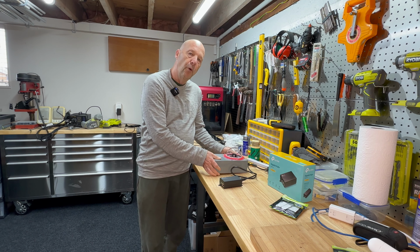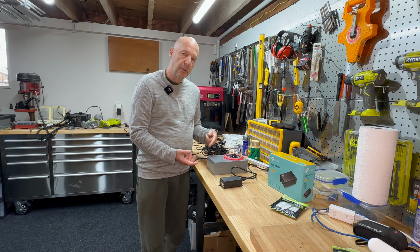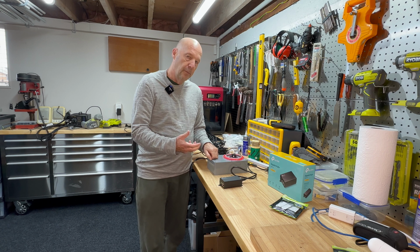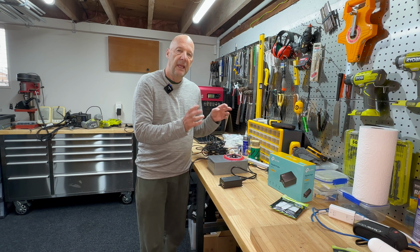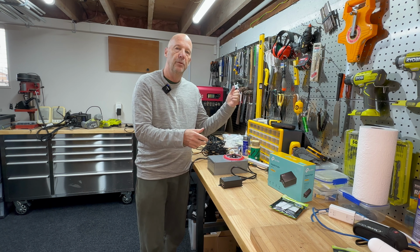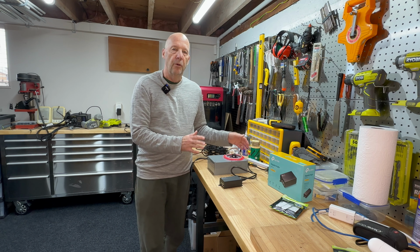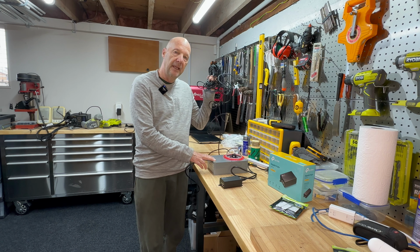Now, before, in my previous video you saw I was running from a PowerPoint the USB-C to power the Raspberry Pi, and that came as a 3 amp power supply, which ran everything perfectly fine. But with that short cord I was going to have to plug that into one of our 240 volt cables to get power from wherever I might have had a PowerPoint all the way out to the Allsky camera. So then I thought, well, maybe it was better to try and do power over Ethernet, hence why there is this very long Ethernet cable here.